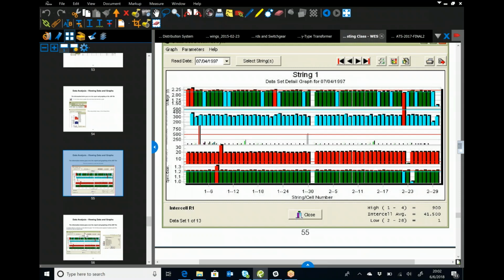And when you get into the wet cells, they're typically a 20 to 25-year design life. And really what they're seeing is somewhere between sometimes 10 to 15, and I've seen them go out in 7 to 8.